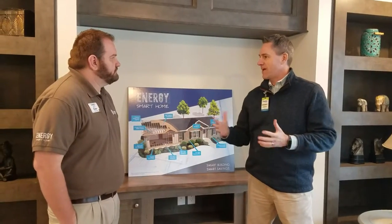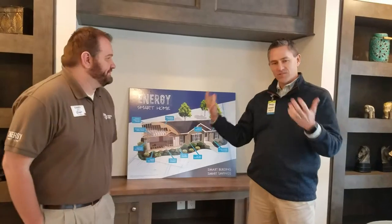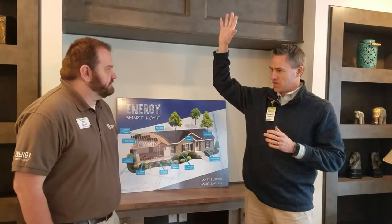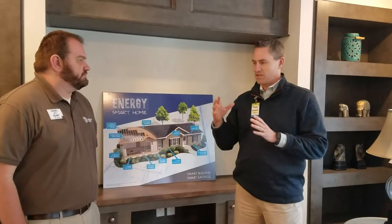The first thing we looked at was the most insulation we could put in a house. A lot of insulation equals low utility bills, so we put the most we could. We've got R33 in the ceiling — that's the most we've ever put in a house — R11 in the sidewalls, and R22 in the floors. It's a 3-1-2 ratio of insulation that gives you year-round comfort.